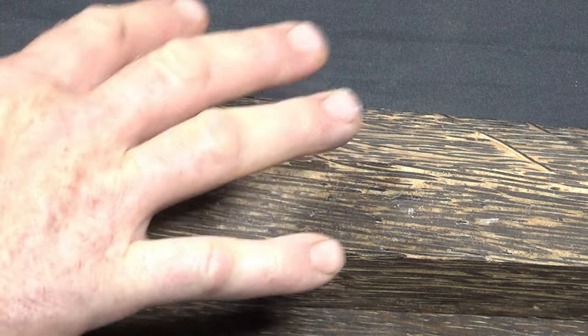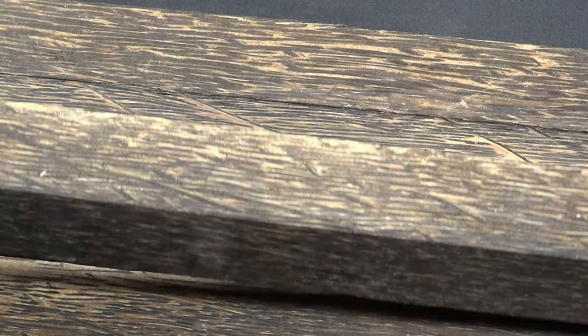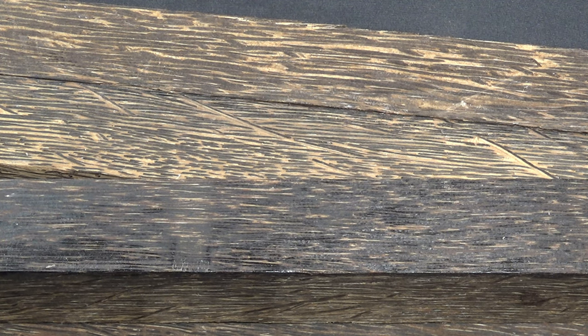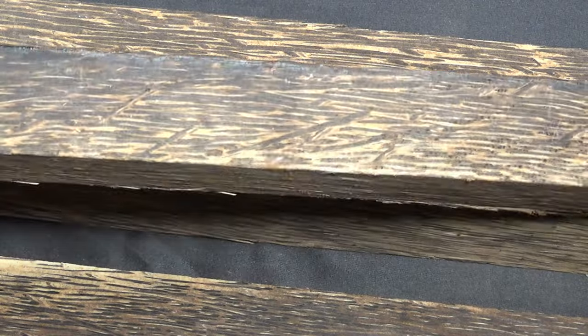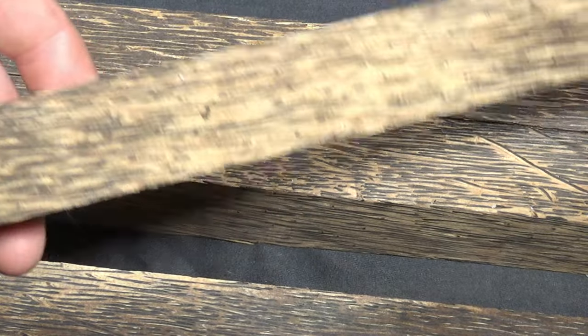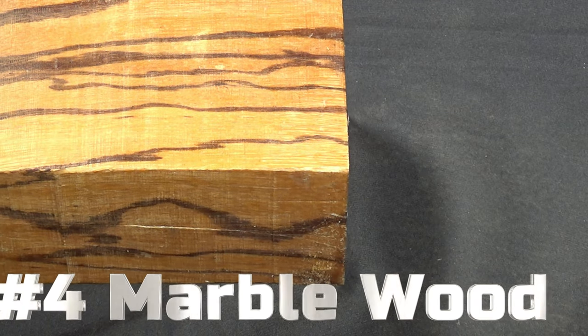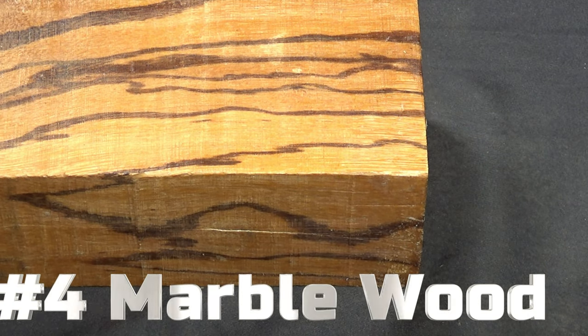Don't put your hand in the box and run it along the wood trying to grab it — you're going to end up with splinters everywhere. Black palm is about 5.1 pounds per board foot, and the Janka is about 1,850 — close to hickory's hardness. It runs about $35 a board foot. Since it's not an actual tree, it's not diffuse or ring porous — it's a fiber bundle. You can see that fibrous bundle structure right here — that's what we're using as wood.